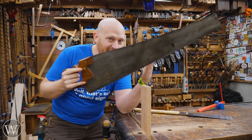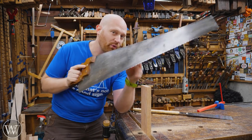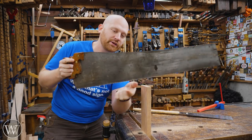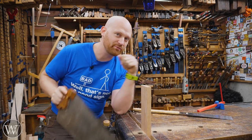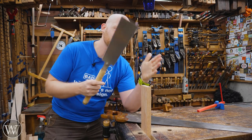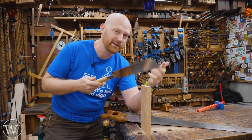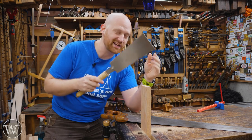So if you find yourself going off course: stop, back up, twist the saw at the point where it starts to go off course, and use the side of the teeth to scratch yourself back into alignment. You can do the same thing with a Japanese saw — it's just a little harder because you have less control over the backside tooth. It can still be done, but just understand it's going to take a little bit longer.